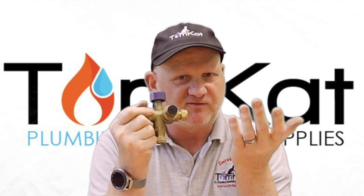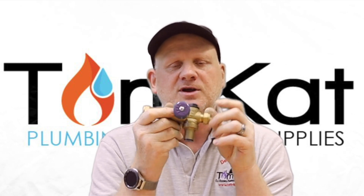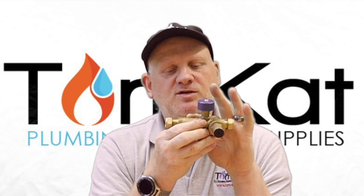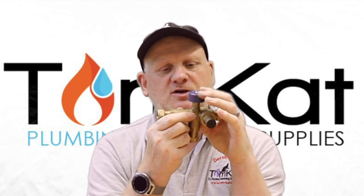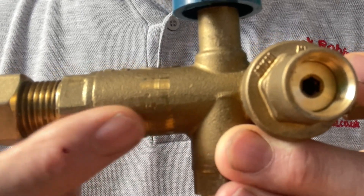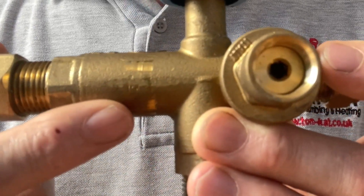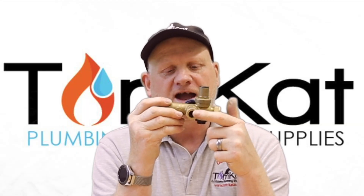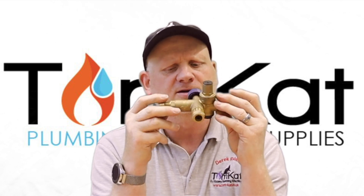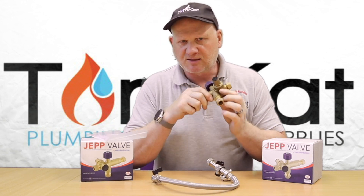If you do need to increase the pressure for some reason, you can do that, but you'll need to put a pressure gauge in the system somewhere if you're away from a combi boiler, because these can be installed remotely from the boilers. The pressure reducing valve allows the water to come through, so when we press the button, the water will go through into the heating system. Built into this section is a check valve to stop water going back and mixing central heating water in with your fresh drinking water. There's also a third outlet here, which I'll explain when we come to install this fill valve.